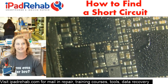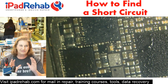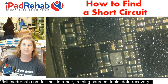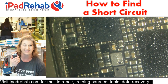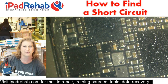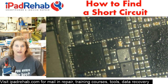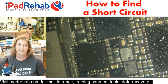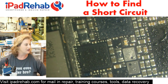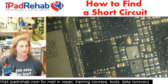That test was instant. There's no waiting for the board, no finagling with the camera, and no lining up images or any of that stuff. So for everybody that asked, Jessa, how come you don't use the $100 infrared thing? Because it sucks. How come you don't use the $2,000 infrared thing? Because the cheap freeze spray is incredibly effective. It has incredibly high resolution and it's very quick. And it does have a cost, but I don't think that in my lifetime I'm going to go through enough freeze spray cans to equal the cost of these $1,000 short detectors. But what do I know?